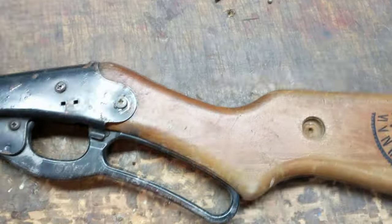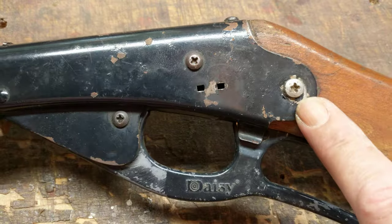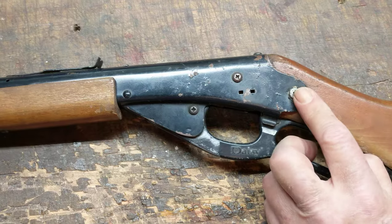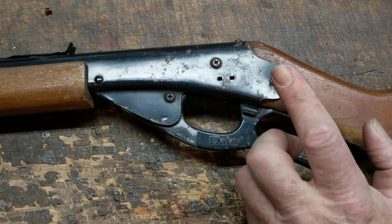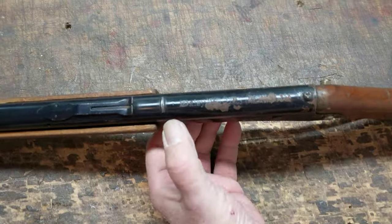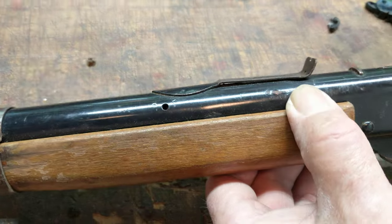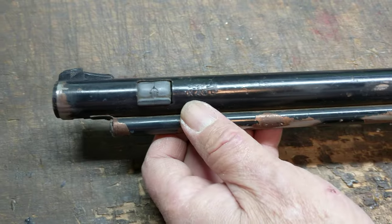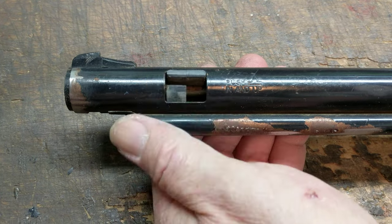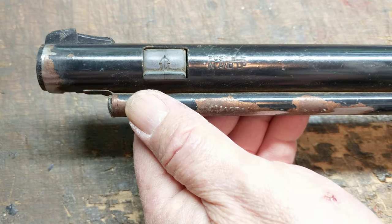There are several other things that need to be done on the gun as well. It has an improper fastener back here that attaches the stop to the rear of the receiver — field expedient, quite stout, does the job — but installing that kind of messed up the sheet metal a little bit on the backside, so it will always have to have a nut. It has the Daisy metal trigger, which is good. It is still set up with a spring block, which is fine. It's missing the rear sight elevator, which is replaceable. Down here is kind of a neat feature — this is the post-78 gun after the abutments were changed out and plastic triggers installed. It's ghosted out to a nice white ghostly color; I'll see if the client wants to get that replaced.